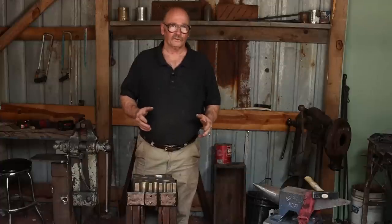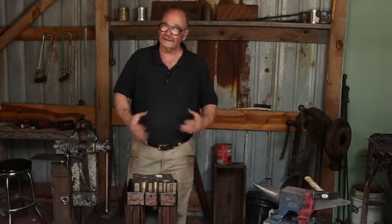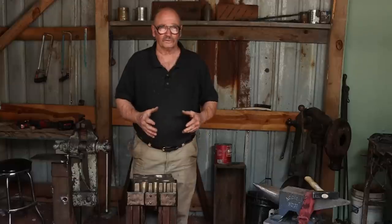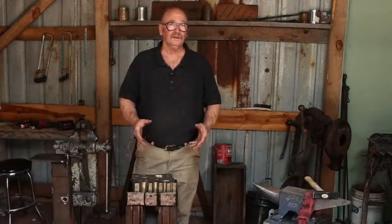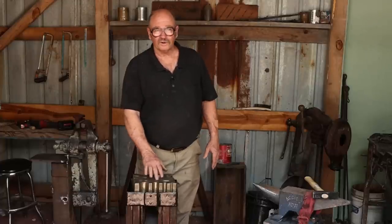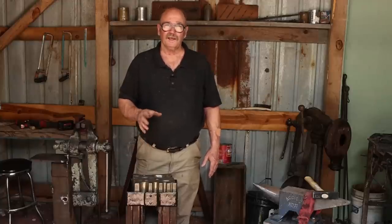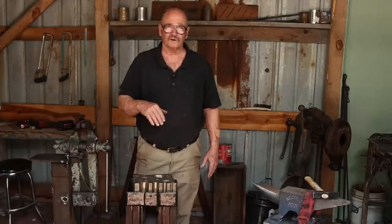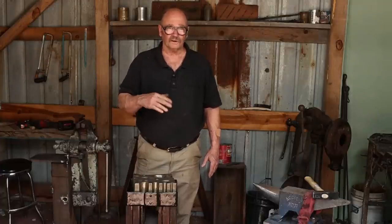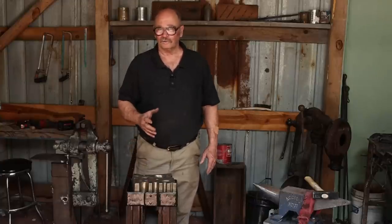Now, I don't necessarily recommend taking a swage block to the level I took this, and of course I didn't take this to a full polish. If you're doing really fine copper work or using this for silver work or something, you probably do need to completely polish all the depressions. But for general blacksmithing, that rough pebbly texture probably isn't going to hurt you anything. And the important thing is to just take the sharp edges off of the edge of the depressions and the edge of the profiles along the perimeter of the block, so you're not leaving gouge marks in your work.